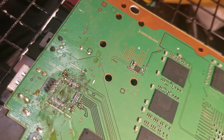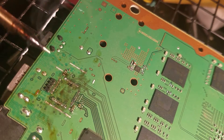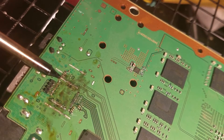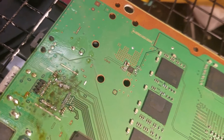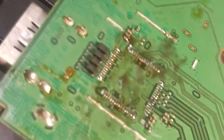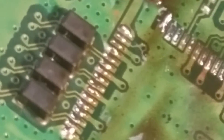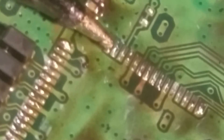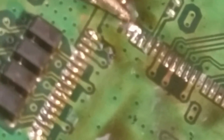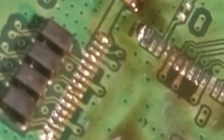As you can see, the one connected there got a little too much solder on it. So what we'll do is just clean off my tip and allow the soldering iron to suck up the extra solder and clean. Actually magnifying on those. Okay, there — pins all separated.